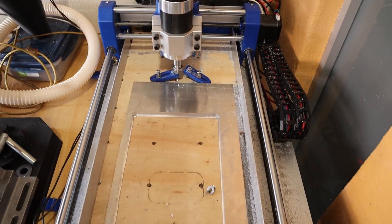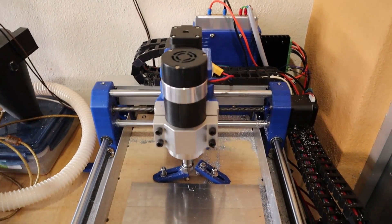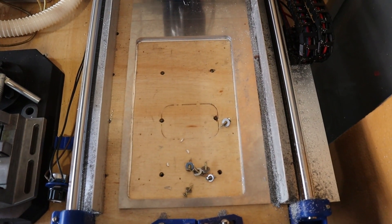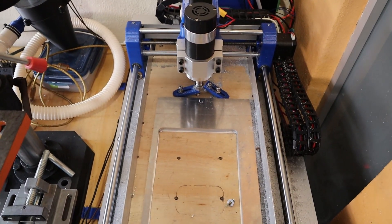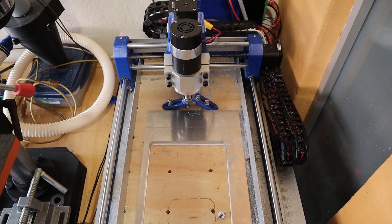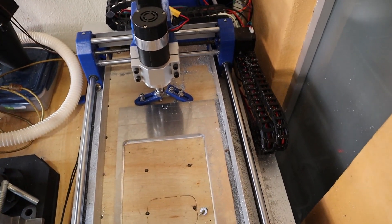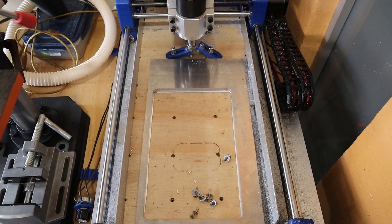It's a relatively small CNC machine built out of mostly 3D printed parts, NEMA 17 motors, and it has a 500 watt brushless DC spindle. This aluminum plate was used to cut one of the parts for my next CNC machine. The design was originally by a young gentleman from Poland named Nicodem Bartnik. I took his design from the internet, bought all the parts according to his guidelines, and built it following his instructions on his YouTube channel. It's a great first CNC machine for anyone who wants to dive into the world of CNC machining, and I used it to machine all the aluminum parts for the next CNC machine I'm building.